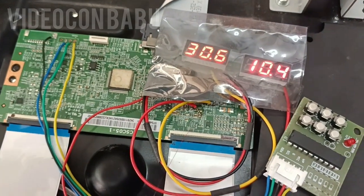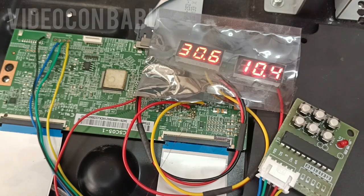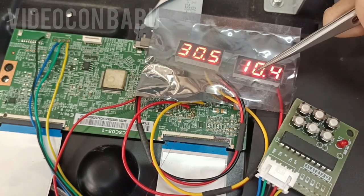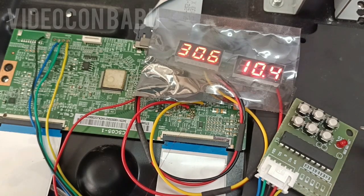The left side Y signals operate the panel. Whenever you switch on the set, within two seconds it will boot the PMIC, and you will get the modified VGL and VGH voltage produced in this PMIC. At that time the problematic side of the panel gets shorted. To avoid this problem we want to delay the boot time of PMIC. That is the purpose of the boot delay timing.